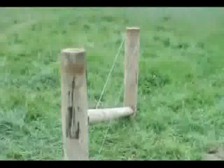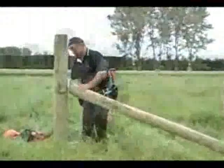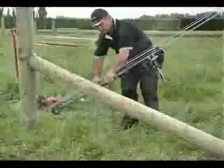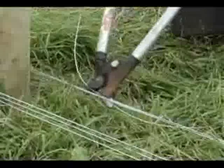Higher fences present no problems. The same fixing method can be used for fences of any standard height. In any case, the wire is looped to the top of the stay post. A gripple or crimp may also be used as a fast, easy way to complete this assembly.